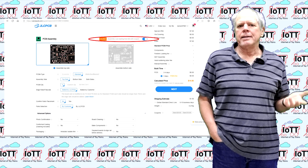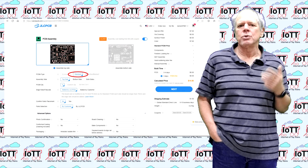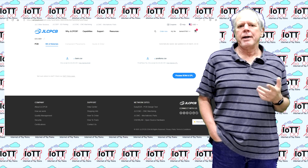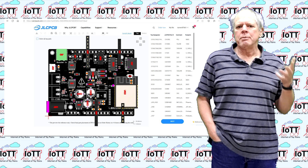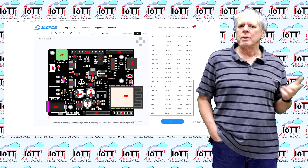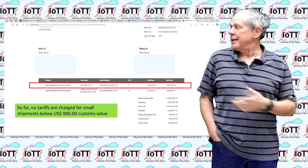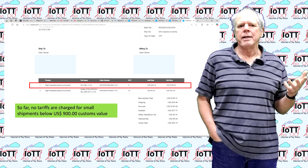At the bottom of the page, I also activated the assembly option. Note that the CSB1 is a 4-layer PCB, so the PCB type is automatically set to standard and the economic assembly option unfortunately is not available in this case. Next, we upload the bill of materials and the robot placement file and verify the components on the next page. I had to rotate the pin headers and the ESP32 module, which also had to be moved a little bit to fit the soldering pads. JLCPCB engineers will be reviewing the order before it is entered into production and if there is anything that does not make sense, they will contact you via email to resolve the problem. The order total for the 5 boards was around $150, so roughly about 25% of what you pay for the commercial boards.